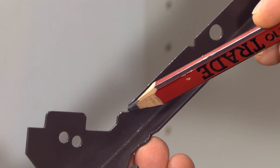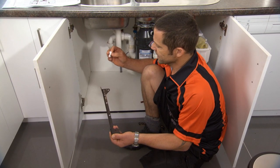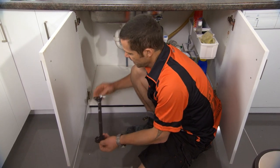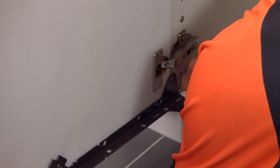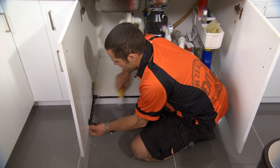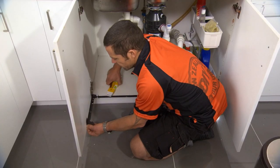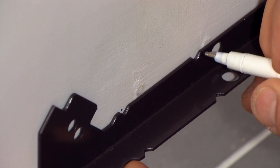I'm using these V marks as a guide to drill the screws, which will hold our door bracket onto the door. To position it, I'm going to take this little plastic lug that goes into our bracket. This plastic lug is going to button hard against the edge of our cabinetry, and the base plate here is actually going to sit on top of the cabinetry. It's really important that we make sure this bracket is nice and level — it's got a nice little baby level here, and that's looking pretty good. Now that it's level, all I'm going to do is mark the center of the V. This is where I'll be screwing the door bracket onto the door.